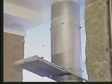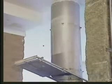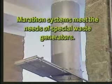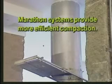Your waste material may be sawdust or material which has been shredded. A compactor can be installed in conjunction with cyclone systems or mounted on elevated platforms so that powdery material can be better compressed into all corners of the system, providing better compaction.